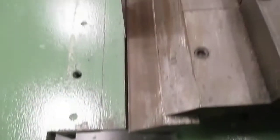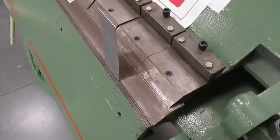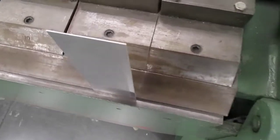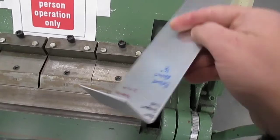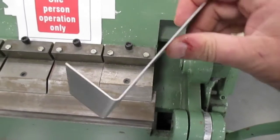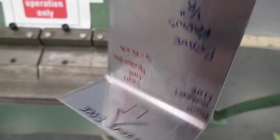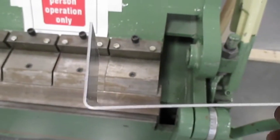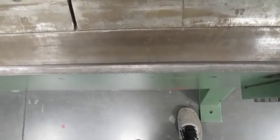I'll give it a little bit more and bring it back. Our piece of material was bent past 90 degrees, but look — it's come back to 90 degrees. When we pull it out, you can see it's maybe just a tiny touch past 90, but pretty darn close. Looking at the layout for the bend tangent lines, it looks nice, even, and straight all the way across, and we've got our angle.